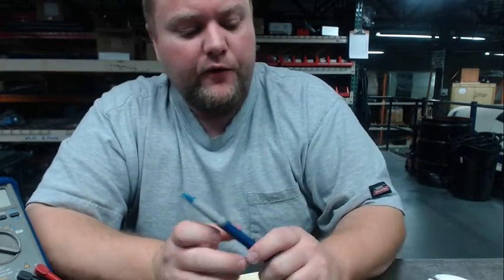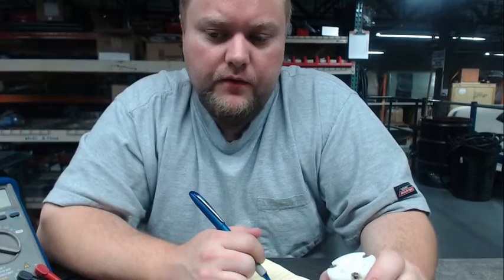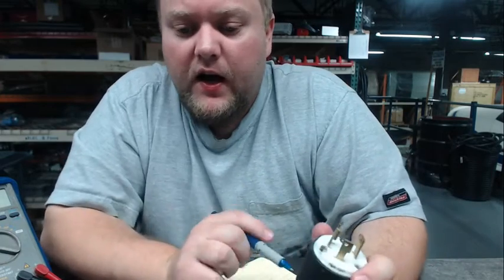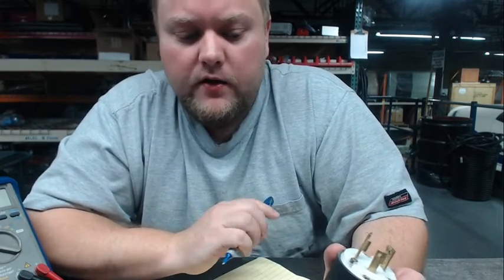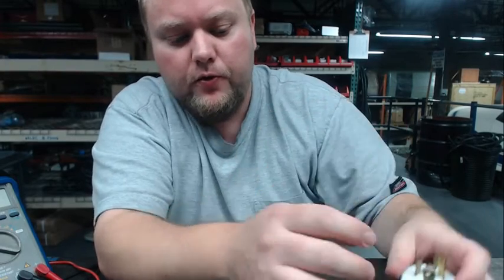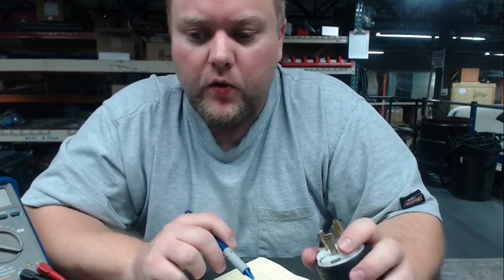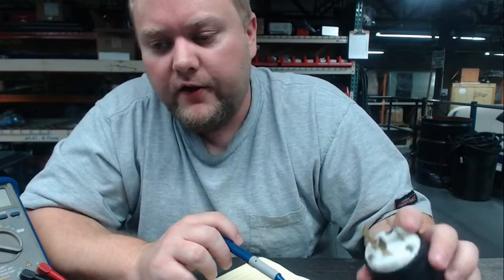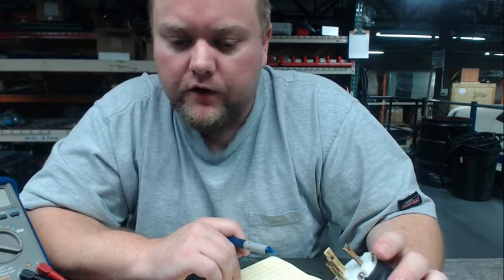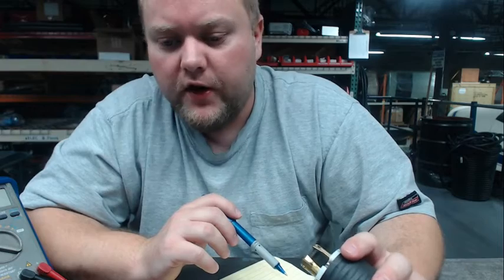So if we're now having to wire a connector to plug into this, our standard i360 power cable uses three wires — black, white, and green. If it's wired correctly to this connector, the black wire should go to the gold screw, the white wire should go to the silver screw, and the green wire should go to the green screw. So in this combination, the black wire wired to the gold screw is your hot wire, the white wire going to the silver screw is your neutral wire, and the green wire going to the green screw is your ground wire.